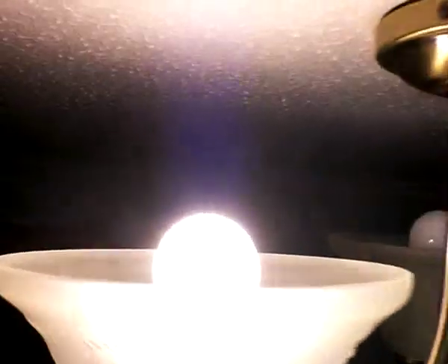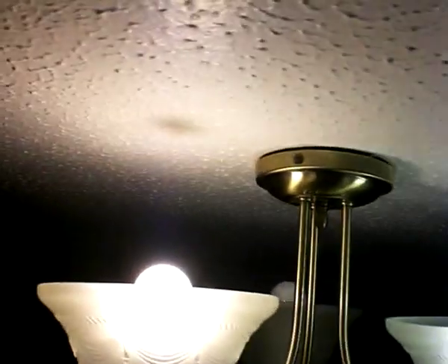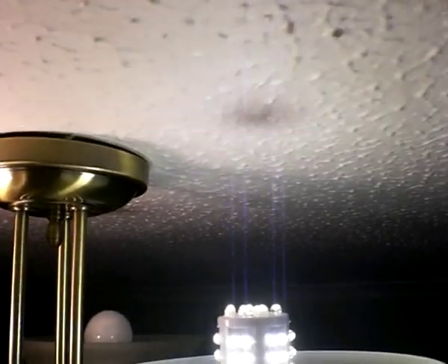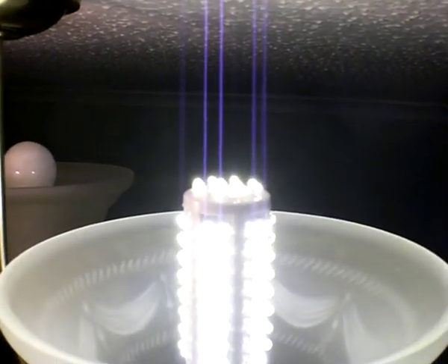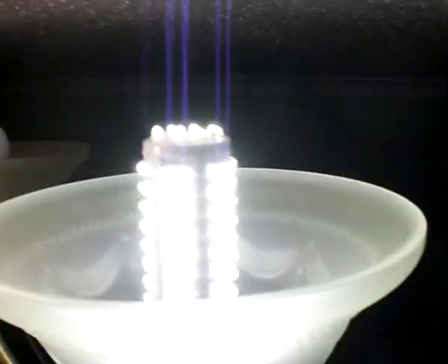This is the comparison of the LED lamp against a 7-watt compact fluorescent. As you can see, there's not an awful lot of difference in the total light output between the two. The compact fluorescent light is a bit more of an orangey warm colour, whereas the LED lamp produces a peculiar sort of greeny-yellow colour almost. Also, this one is flickering, whereas the other one is not so much of a noticeable flicker.